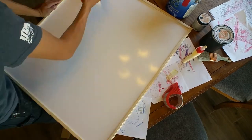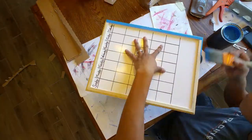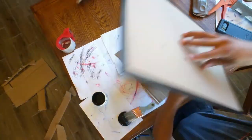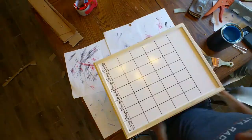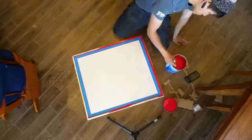This edge didn't turn out very well with the router — the wood's not that great and the router bits probably aren't that great either, so it's a little rough. So we're going to do some caulking on the inside edges just to clean that up and make it look a little nicer, using normal painter's caulk. Get that all cleaned up and start painting these. We really like colors in our family so everything that can be is nice bright colors — this one's black, so not bright but very strong colors. On the big one I decided to use some painter's tape for the inside edge so I didn't have to cut it in by hand, though painter's tape never gives me the best result.